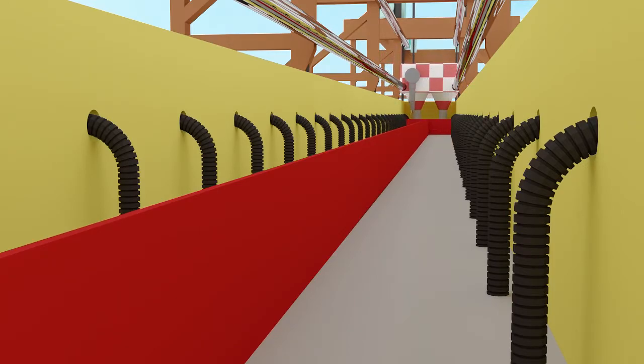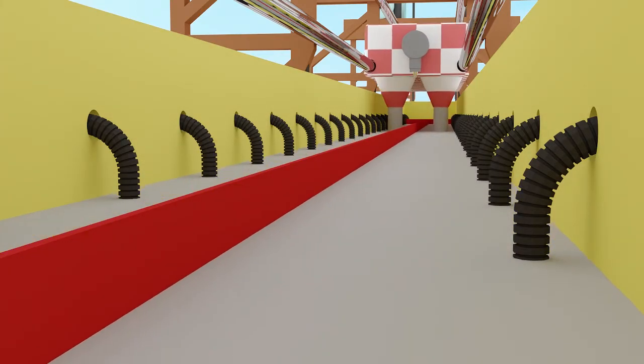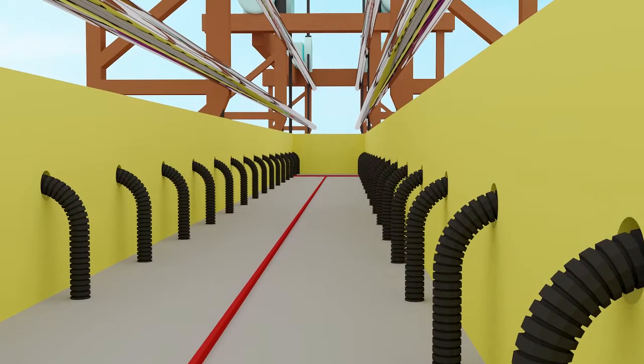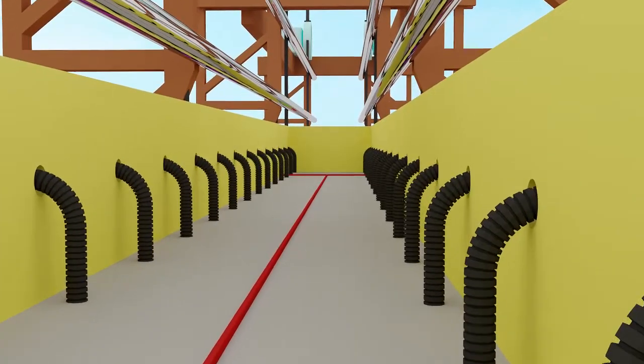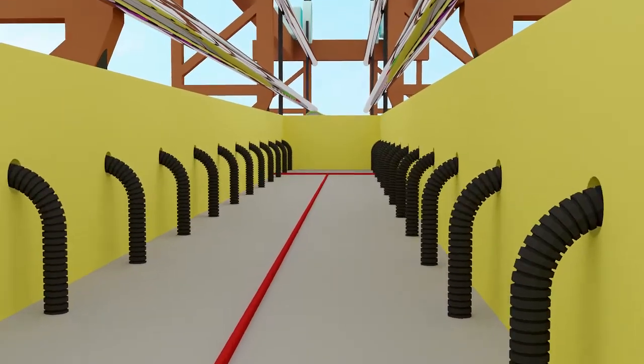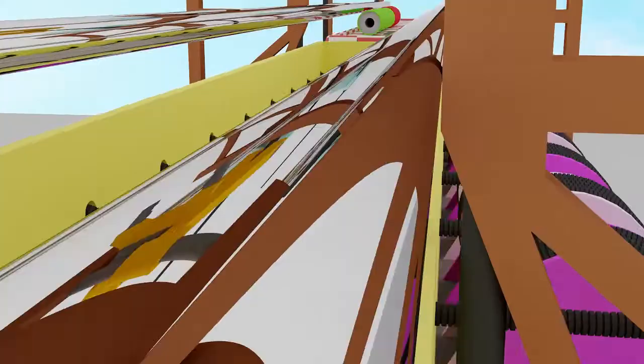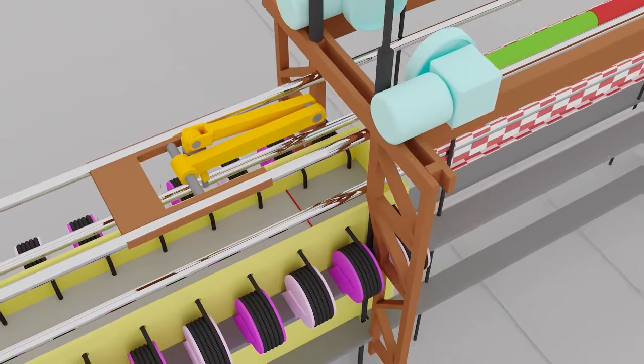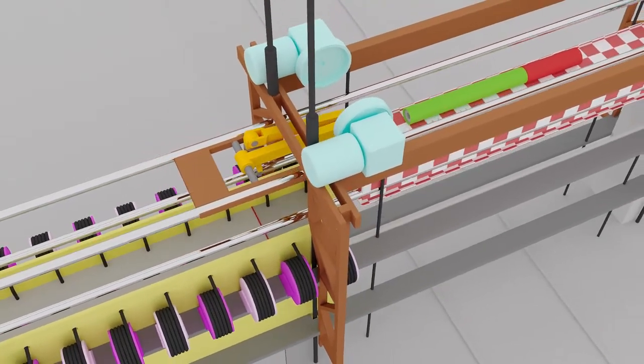The carriage cart is equipped with concrete dispensers. When the cart is moved along the formwork, the dispensers release the concrete in accordance with the central program that controls the flow of concrete into the layer being formed. This limits the thickness of the concrete layer to not exceed 5 to 10 centimeters, which reduces the load on the formwork structure and, in turn, its weight and material consumption.